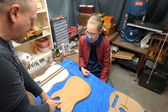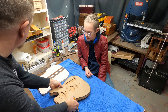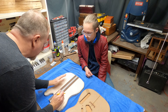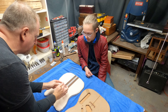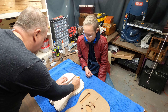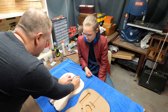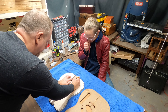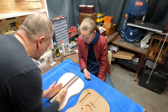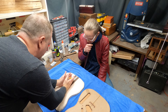We're just taking a pencil and I'm going to start putting lines across it. I'm not pushing hard because I don't want to make any indentations, especially on these edges. I'm just going to make a pencil line. The reason I'm doing that is I want to see the pencil lines disappear evenly — when all of the pencil line is disappeared, we should be pretty well flat. This will just help us to be able to see how evenly it's sanding.